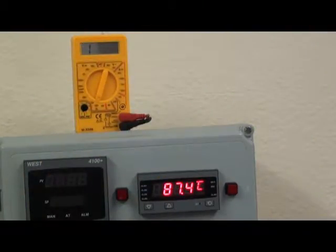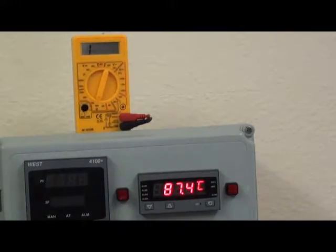This particular indicator has been programmed and configured to accept a PT100 input signal. An alarm board is fitted that will activate at 120 degrees as a high alarm. The alarm status is indicated on the multimeter, and at the moment it is in the open contact position. I will simulate the PT100 input signal with the decade box.